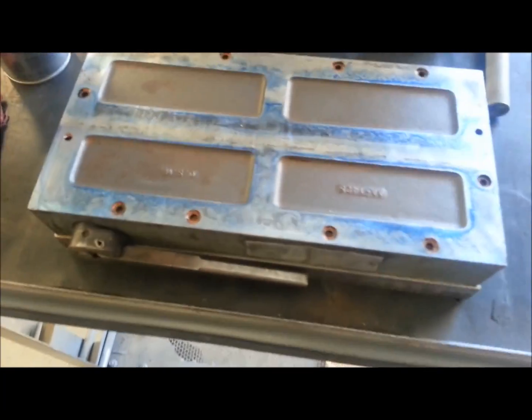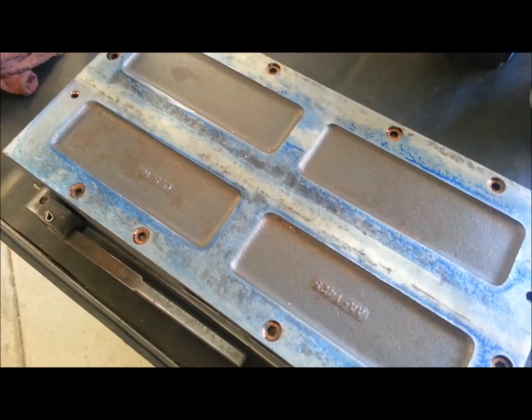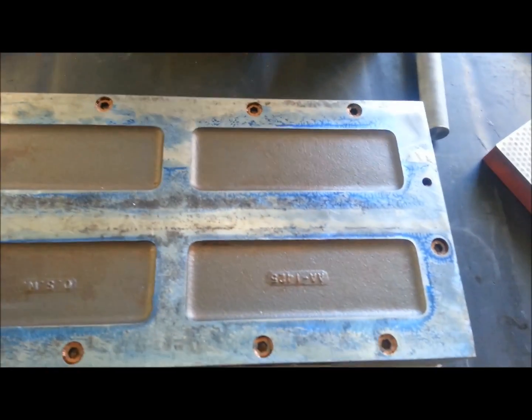Today is the day I'm reseating my magnetic chuck. I've been doing some transfers between the bottom of the mag chuck, and I've just been using a 600 grit diamond block to hone it down and to get good contact.